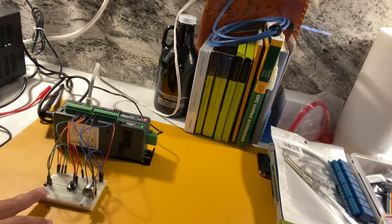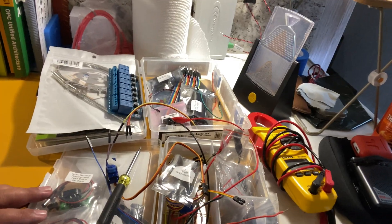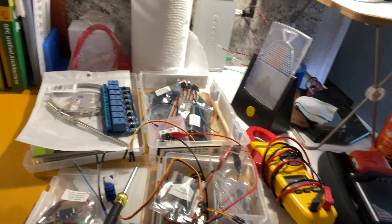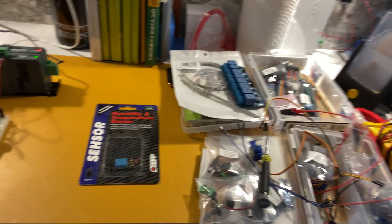I wanted to give an update in the middle of the development. Anyway, that's where I'm at right now. Real quick: I've got a push button, a pot, and an LM35 sensor. I'm actually going to control a little micro servo out of it, and I have a little Arduino temperature and humidity sensor that I'll probably drop in there too, just so I end up with four or five different pieces of instrumentation. I was going to throw a thermocouple on there, but I had the smaller sensor so I'm just going to use that. I'm actually really impressed. I'm grateful that FreeWave gave us the opportunity to review it first, and I hope you guys end up liking the content. Thanks.